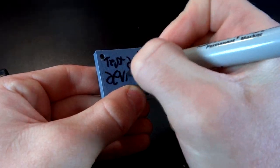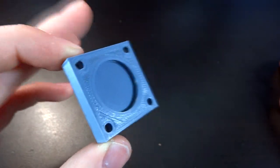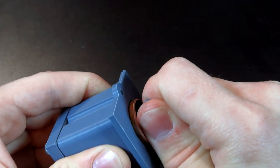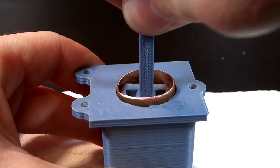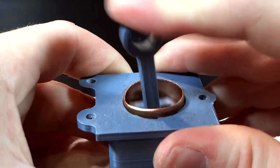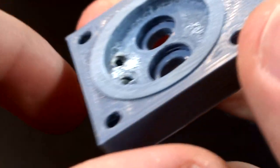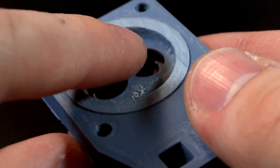To make sure that the air is escaping through the valves and not elsewhere, I've made this little test device — a head that doesn't have any holes in it — so if the air is still escaping it means it must be escaping around the edge where the gasket was sealed. And as you can see, that is really, really good. That is very impressive. It's absolutely perfect. It even acts like a spring and draws a ton of vacuum, but my theory is that the air is actually escaping through the plastic itself. You can see there are little pores along the seats at the bottom, and I think that's just due to the printing. This is what inspired me to put glue along the inside to seal these off, so the air will have no other place to go.